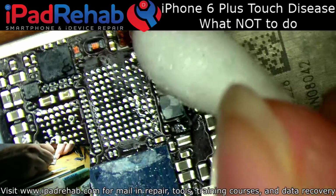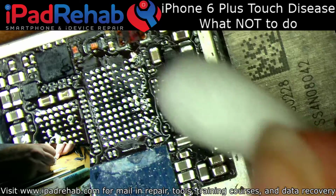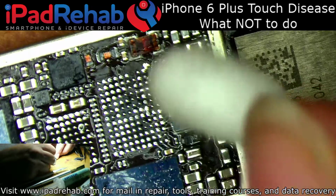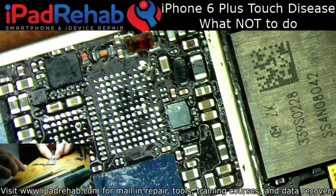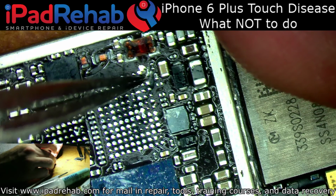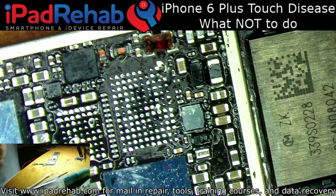So if you're going to place a jumper there to fix the broken piece of copper that's already in the board, well, why not put a little bit of slack in the line so that future bending and flexing can't put stress on that exact same spot? So I kind of do an L with my jumper to give it a little bit of wiggle room.